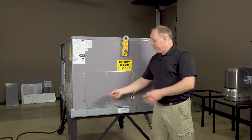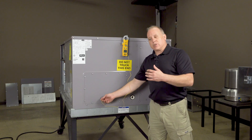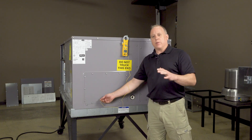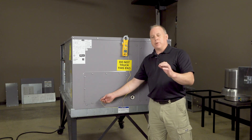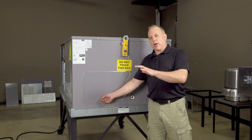When we get in on the heat side, we get just inside — be careful. Make sure when you put that probe in, you're not hitting anything metal, because that would be the heat exchanger. That temperature is going to be extremely hot on the heat exchanger, so you just want to be in the airflow.